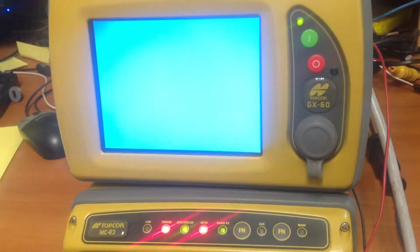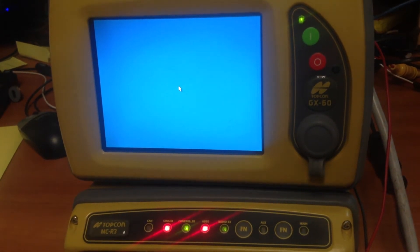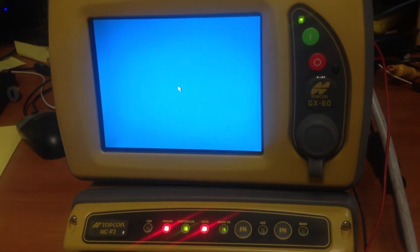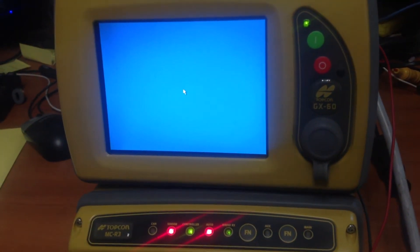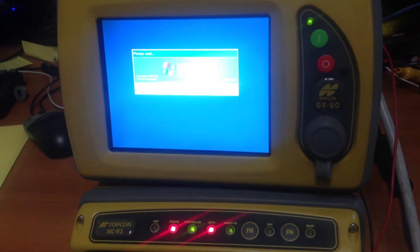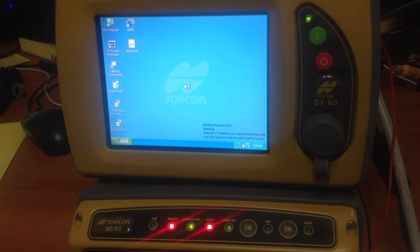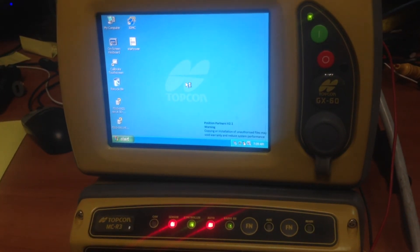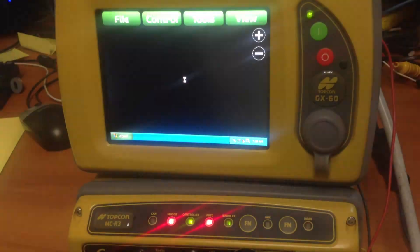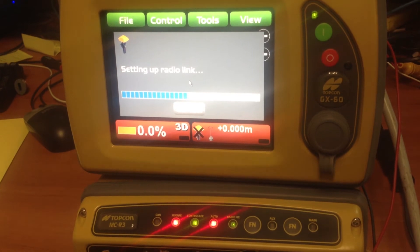When it comes back into 3DMC, we can check. We'll go into the satellite screen and we'll check to see — we'll probably see it's picking maybe 5 or 6 satellites up straight away. But if it was seeing 15, 18, or 20 satellites straight away, you can pretty well be certain you've not done it correctly. There is also an almanac we can check — if it's picked up that information straight away, then you've certainly not done it correctly.